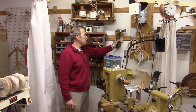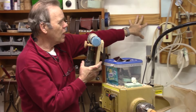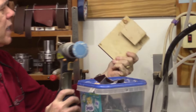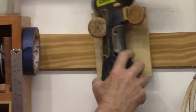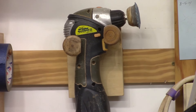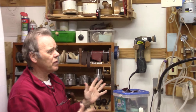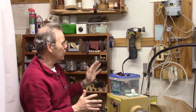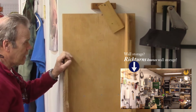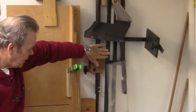I mentioned my French cleat system — basically it's a 45-degree angle cut on two matching pieces. You take a four-by-eight sheet of plywood and rip strips of about three and a half inches. It's extremely versatile because you can make any little adapter for almost any little tool, and it really lends itself to rearranging your shop by just picking up an item and moving it somewhere else. The key to the French cleat system is to do it early in your design, because once you start putting things on the wall it's very difficult to go back and add one. Wall storage can be very handy especially for larger items such as a table, the guard on my table saw, and my Lyle Jamieson hollowing rig.